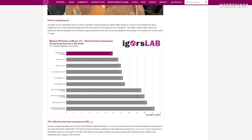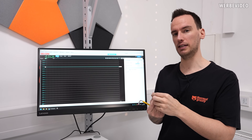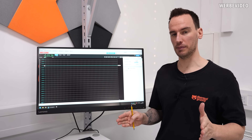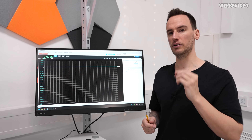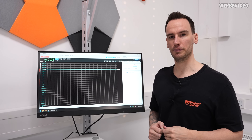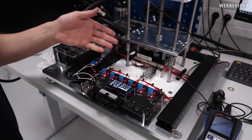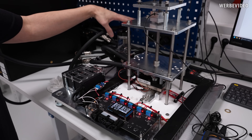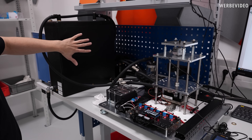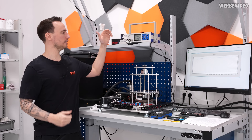That alignment is interesting even though we have a 9 times larger contact surface — 30 by 30 millimeters versus Igor's 10 by 10 millimeters. With a larger surface area you're slightly more likely to encounter larger particles due to Gaussian distribution, but we're still right where we want to be. Now we switch the heater on — all six channels active running at 40 watts each, equaling 240 watts total. A pump actively circulates water through the water block, feeding into a 25-liter reservoir to minimize temperature variation, then through an industrial chiller to control water temperature.